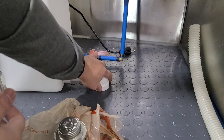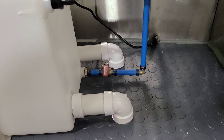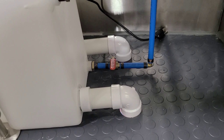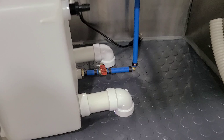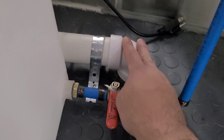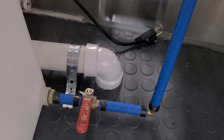That's how we connect it on — the fresh water tank drain going down. We're going to do the exact same thing on the gray water or wastewater in the back. So there we go — that's how the inside is going to look. We have both drains with the vent elbows, the little short elbows going down. I put a little galvanized strap on here just because it was a little wiggly — it wasn't fitting nice and snug in the hole, coming off and on — so I wanted to make sure it permanently didn't move.